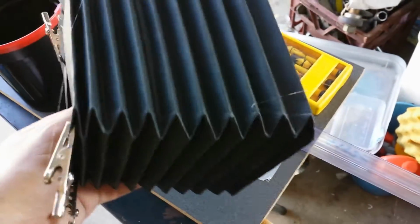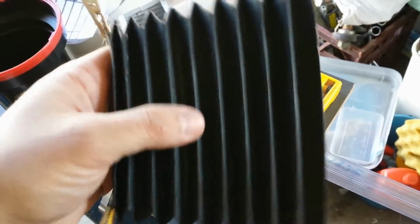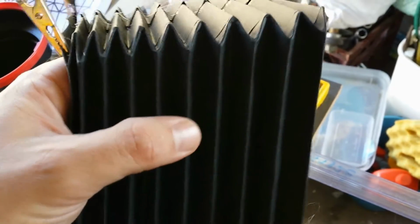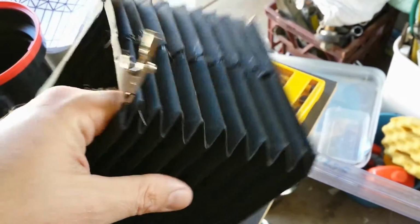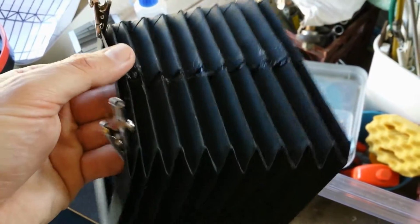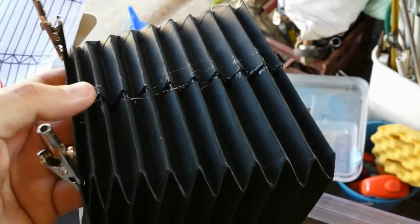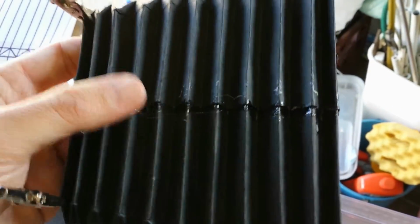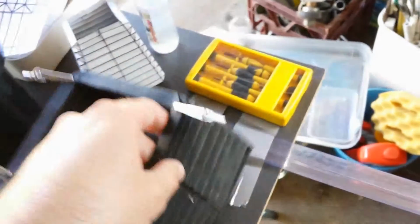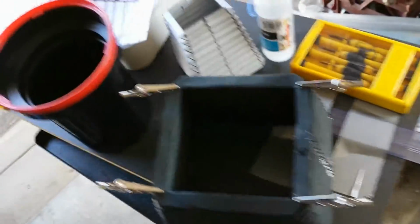Anyhow, I've made me Mark III bellows, which is larger and better and good for my plates. I used much stronger black cardboard paper, which I bought from the El Cheapo store in Westfield Fig Tree, and it's pretty much only got one seam, and I just fold. So I made this all in one piece and folded it and glued it up at the seam. This time using craft glue instead of super glue, which has got good flexibility.